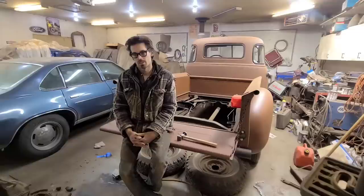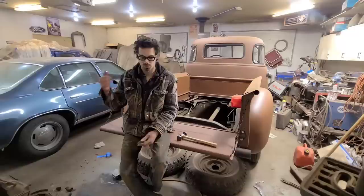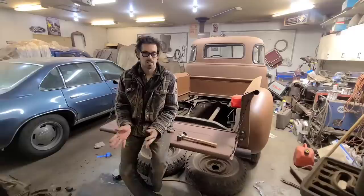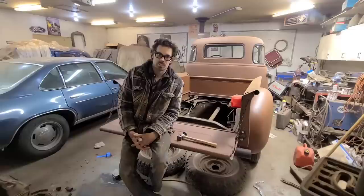And the other thing is, you sand across it with 80 or whatever, and all those little dots completely disappear. Whereas when you heat stuff up with a torch and shrink it, there's usually kind of a ghost of shrinks past. I'm not saying it's better than the torch, but it's been working for me. So hopefully that makes a little bit more sense.